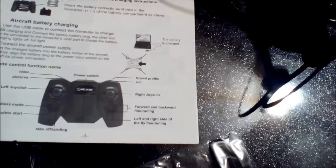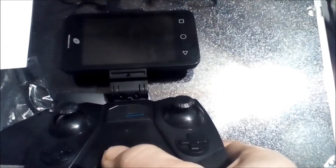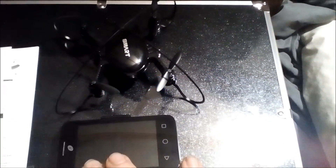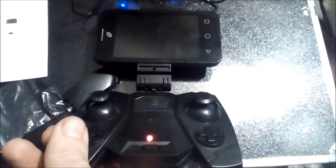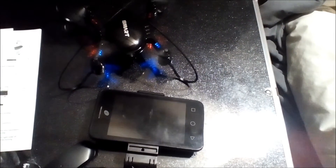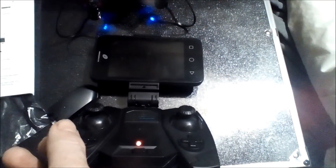We're gonna connect via the controller. Turn the controller on — lights are blinking. Throttle up and down and the lights go steady. Up and down won't do anything until you press the left T button — press it, and it arms. Press it again to shut it down. If you press the left T and then the right T it will do an auto takeoff.